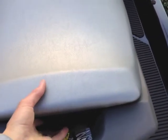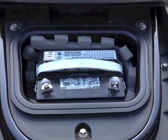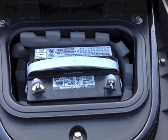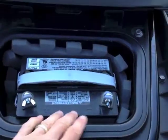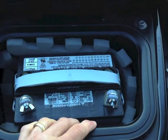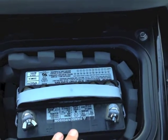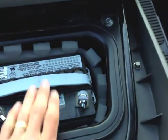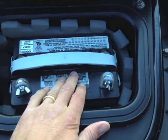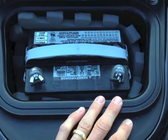This is the back of the 2012 Yamaha FX. Here's the battery box. Now this is not a battery box until you do some modifications. On the Yamaha WaveRunner this box had a solid top and it's a watertight box that you can use for storage. So I cut this top and opened it up so I could mount a deep cycle marine battery — this is a smaller battery for a trolling motor application.